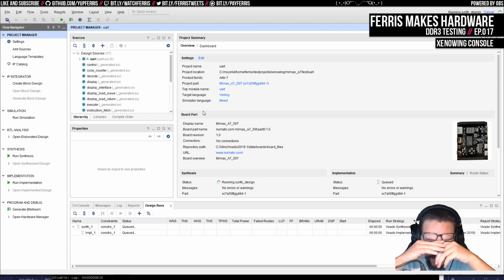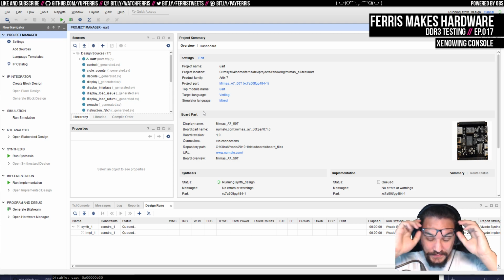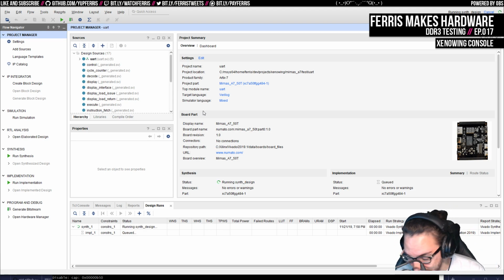I'm thinking, by the way, for the vector unit, I need to come up with proper names for these again. I remember coming up with Color Thruster for the rasterizer. Maybe I'll stick with that again. I think that's fun. But for the vector unit for vertex processing, I was thinking to do integer, maybe 4 or 8 integers wide, just straight SIMD. And since it's essentially going to be another CPU, I want to keep it as simple as possible, so I'm going to make it fully pipelined.